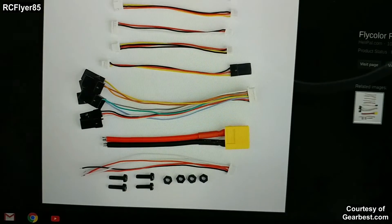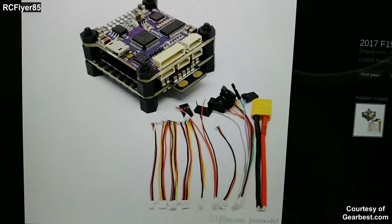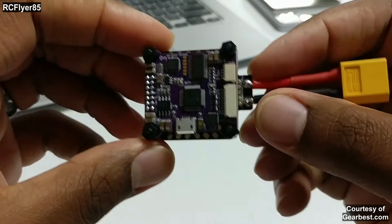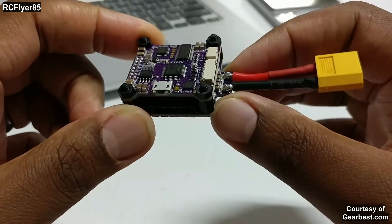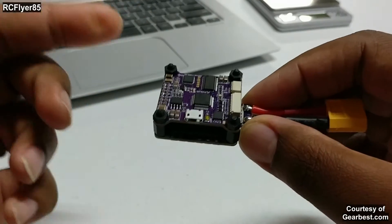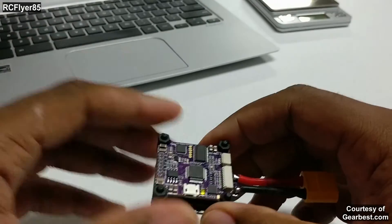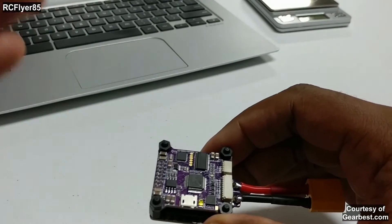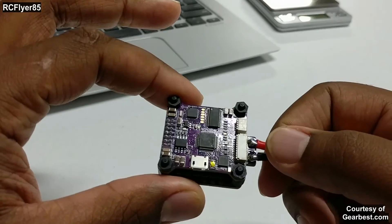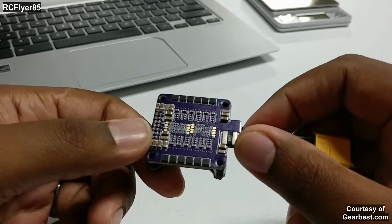These are the cords you get with it — very basic. Now here is the upgraded S tower version. I personally like the new layout a lot; these pads are separate and really easy to solder. The big thing about these is that they are BLHeli S ESCs. What does that mean? You don't need to tell it what protocol you're running — whether it's Oneshot, Oneshot42, or Multishot. You can just plug it in, go into Betaflight, select Multishot, and it'll start working. D-Shot you will have to flash, but right off the jump Multishot just works. That is the advantage of BLHeli S ESCs, which this new tower now has.